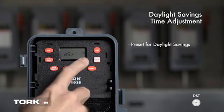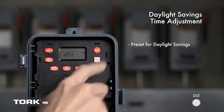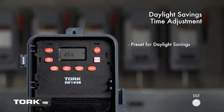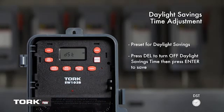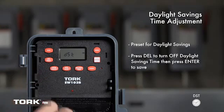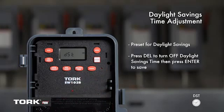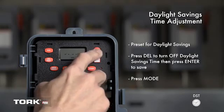The Tork EW103B is preset for daylight savings dates. This is indicated by DST on the LCD screen. If you live in an area that follows daylight savings time, then nothing more needs to be done. Simply press Mode to continue. If you live in an area that does not follow daylight savings time, press DEL button to change screen to DST off, then press Enter. We will leave daylight savings time on for this example. Press Mode to continue.